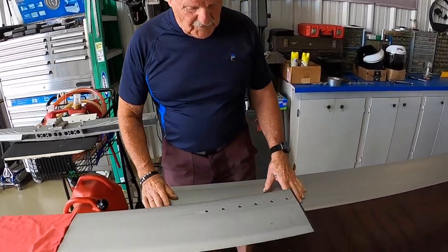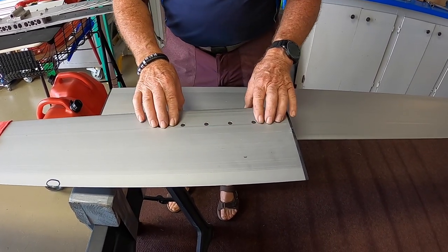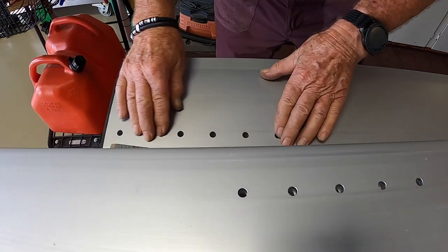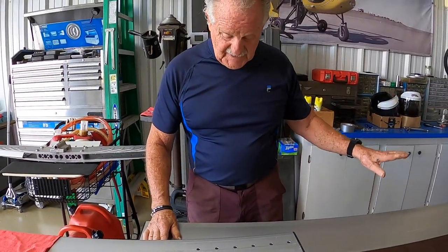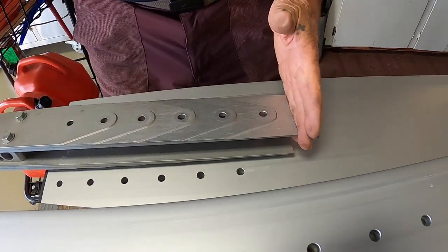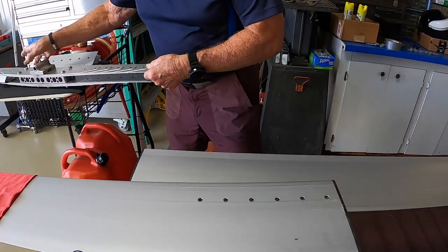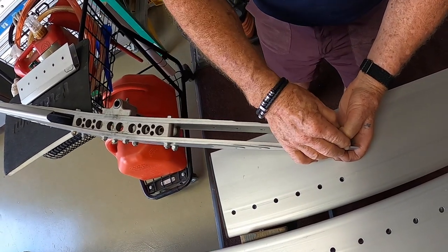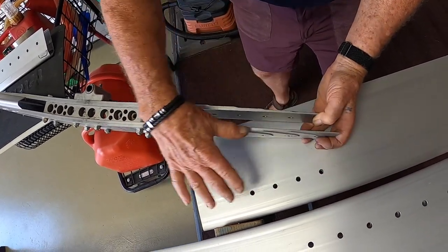Once you've disassembled the rotor blades from the hub bar, the whole purpose is to inspect for possible cracks around these holes. Check both sides of the rotor blades, and obviously both blades. There's a lot of stress here because the blades flex a lot when in operation. The flexing occurs where the hub bar meets the blade. The hub bar is tapered by design so it doesn't concentrate all the stress in one spot — it creates a progressive stress area. That's a good design.